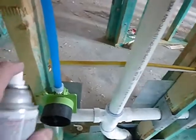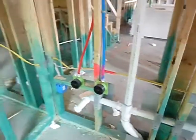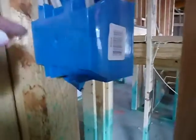Coming down here, is that closer than 1.5 inches to the edge? We need a nailing plate here. Anywhere you see this pink paint, that's me. Coming along. Is that 1.5 inches away from the wall? I don't think it is. We need a nailing plate here. Alright. Coming along. Is that 1.5 inches? Oh man, that's close. No, it's not 1.5 inches. We need a nailing plate here. Sorry about needing a nailing plate. Oh man, hope it doesn't ruin somebody's day.